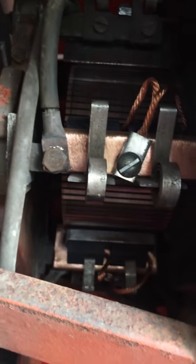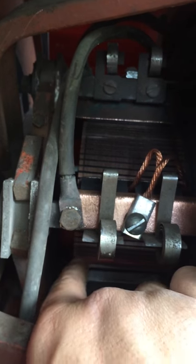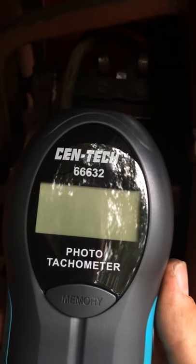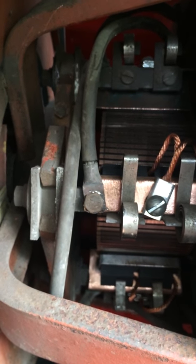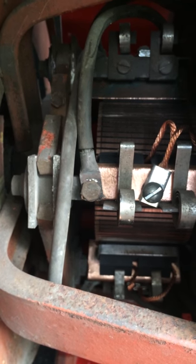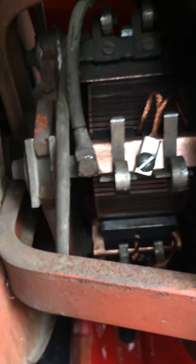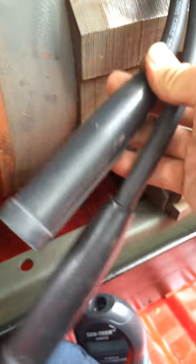To make it easy — since my truck is backed up, I have a flat cap and can't remove it to get a front speed measurement — I took my cover off from my armature. Right here on the edge where you can see the brushes don't ride because the copper is shiny, I've got a piece of reflective tape that my tachometer will pick up on. I'm going to show you high speed and low speed idles to demonstrate that I have it set at 1050 low speed and 1550 high speed. After that, I'll show you I have no more than 93 OCV output between my leads.